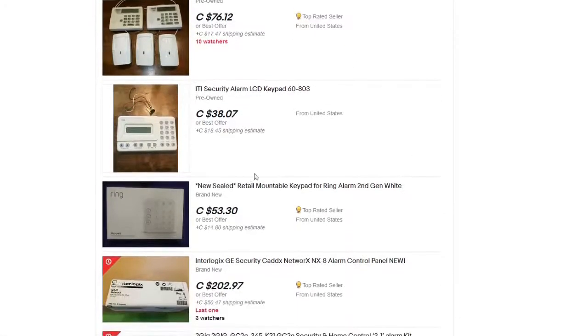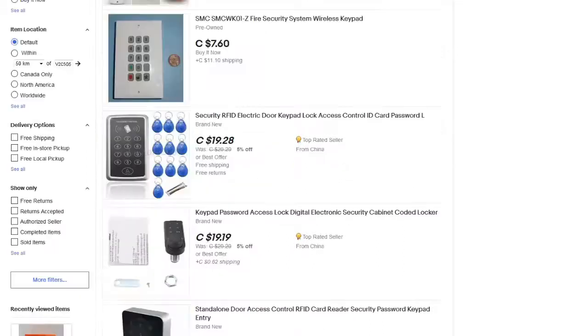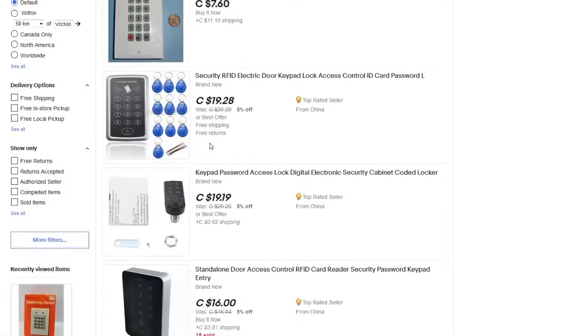China would be cranking these things out — and they do, kind of. You get these for $19.28, sure, but no tactile keys, it's a membrane. You have a doorbell button because it's designed for a doorbell. And RFID. These older security systems are not all that secure, but adding Chinese RFID fobs to an 80s system is a terrible idea because anyone can clone that key and you don't even need the key code. It's terrible.